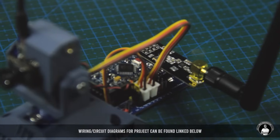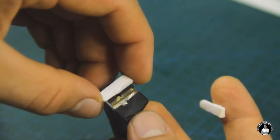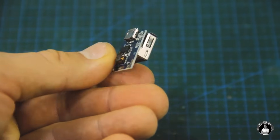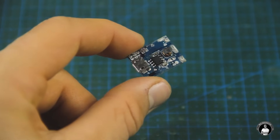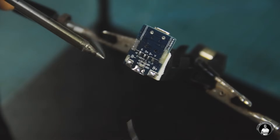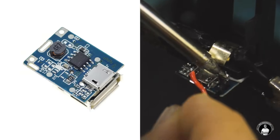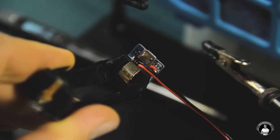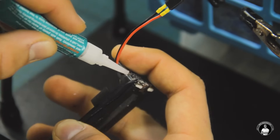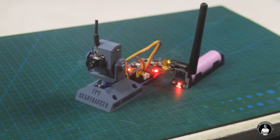After attaching the 2.4 GHz antenna, our head tracking camera unit is fully assembled and needs a source of power — an 18650 cell. We'll take the 18650 battery holder and use double-sided tape to mount a 5-volt boost converter USB module with its USB Type-A header desoldered to make it more compact. This board sticks onto the positive terminal side of the battery holder with the boost converting circuit pointing inward. Solder the positive terminals together directly and the negatives through a wire of the right length. For the 5-volt output side, solder wires to the tiny pads leading out to a female pin header connector for easy connection to the receiver board. Insert the 3.7V battery with the positive terminal facing the converter board and supply the stepped-up 5V to the receiver board through its 5V power input pins.